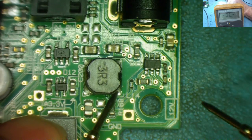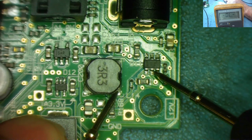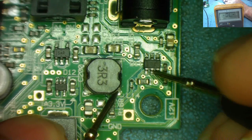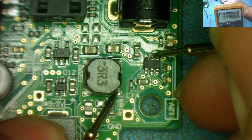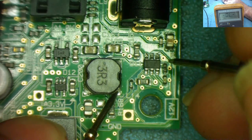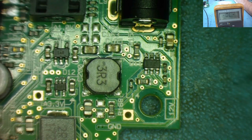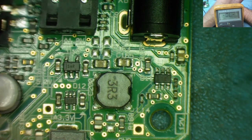If we go from this end of the coil, I'm sure that comes to here as well. I'm pretty sure it'll come to here. Let's have a look. Yeah. So this one's like 12 volts in, output to the coil and ground. Okay. So we'll take that chip off, the other one, and then let's stick in some voltage and see what gets hot if that chip isn't short.